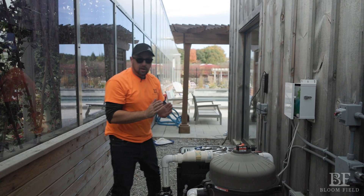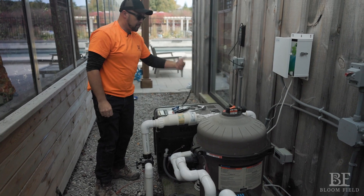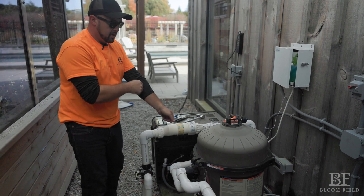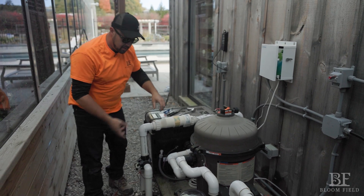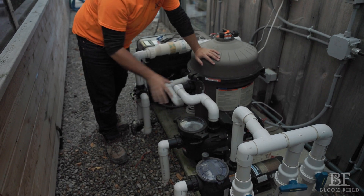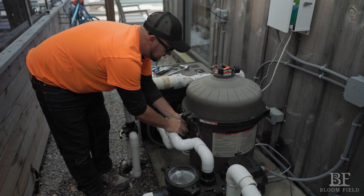So we're at our pool equipment. All of your pool equipment is virtually the same if we installed it. Sometimes the pipes come out of the heater in a different layout based on the amount of space you had. But all of you will have a pump, a filter, a salt chlorinator, and a heater. You may have a gas or a propane heater, and a few of you have a heat pump. Those pipes in the bottom underneath the skimmer basket run underground and come up here in the front of our variable speed pump.